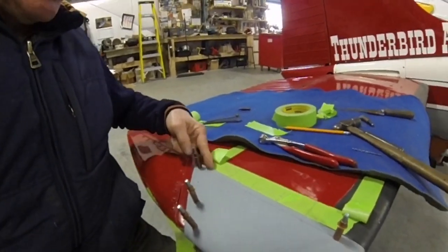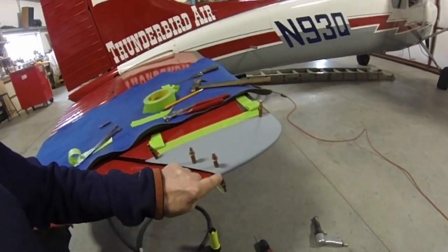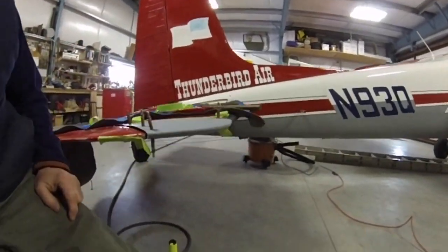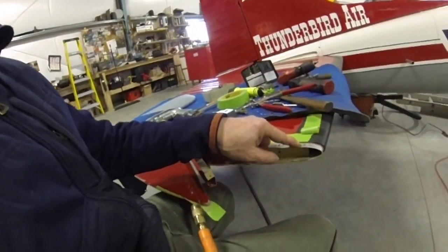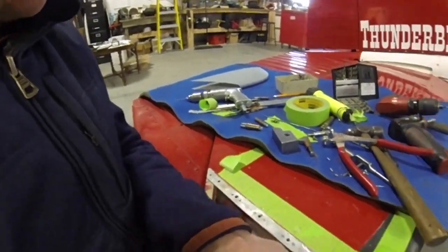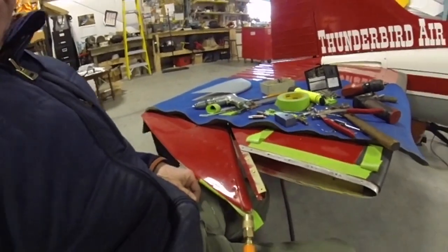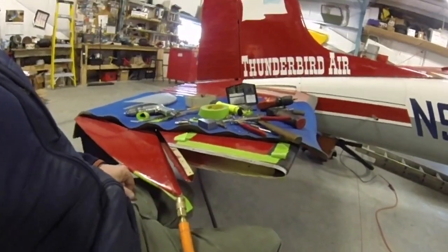You also want to watch this edge here. I'm going to have to come back here and trim this edge off, watching out that I don't get too close to my screw edge, and also make sure you're straight there. Here I am putting in my nut plates — I got one, two, three, and this one on the end put in. They're turning out pretty good, seem to be in a pretty straight line. I got a line mark down there to keep me centered up. There are a lot of little nut plates in here — a little time consuming, but that's what it takes.